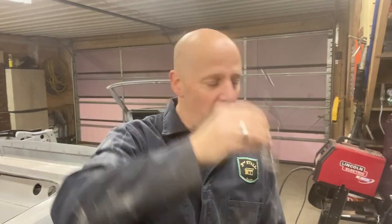In Fitzy's video, he talked about welding sheet metal. He puts it on the same wire speed and he uses the same settings for A, B, or C in terms of the heat. I'm not finding that to be true for my welder. It seemed like when I went from setting A, wire speed 3-4-ish was good, but when I went to B, it was more 5-6. When I went to C, it was more 7-8. So I think I need to play around with that.